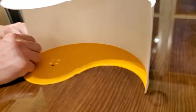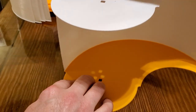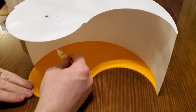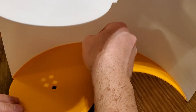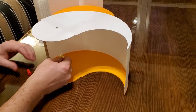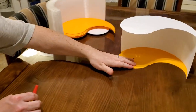You just want to push this piece forward until it's close — you don't have to try and get it perfectly flush, just close is fine. Once it's seated in that little channel, we're going to include a little tube of superglue for everyone. You don't have to run a continuous bead because you won't have enough superglue for all of that — probably just hit it in a number of spots. You don't have to do it inside and outside, but be sparing. You have a tube of superglue that will most definitely give you enough to get all of your scoops together.